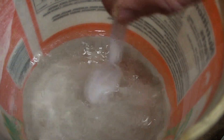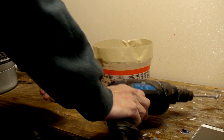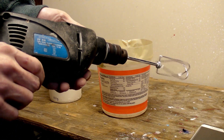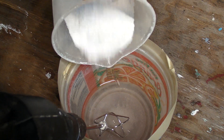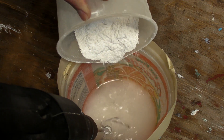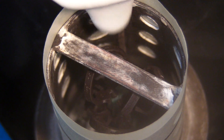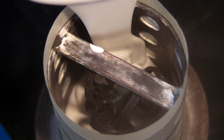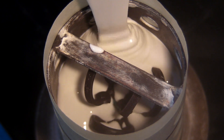The boric acid is added to distilled water. Some casters dissolve the boric acid into warm water, but I simply give it a swirl and add the investment powder. Using very sophisticated mixing equipment, I begin to mix in the plastic cast investment powder with a ratio of 38 to 100. The mixture is vacuum degassed and poured into a flask. They are vacuumed a second time and left to dry for 3 hours.